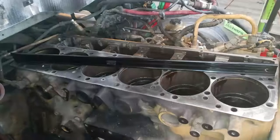That doesn't just apply to cylinder blocks like this. It applies to cylinder heads, any gasket surface — front structure seals, thermostat housings, anything. I'm talking about flat surfaces that use a gasket, and they're pretty much all uniform: I want them flat, I want something I can measure. At the end of this, we're going to be measuring with a straight edge — also something no one ever showed me to use when I was an apprentice.